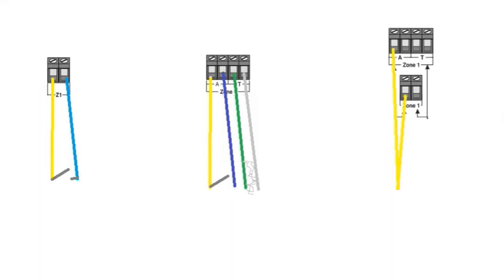And then from here, we'll go through, again, the reed switch. And this reed switch is again currently open, okay? But we need a resistor. What's a resistor? Well, it's basically something that gives resistance on the cable. So when we go through the panel, it's going to be easier to describe. It's a little bit of metal, and in the middle of that bit of metal is a variable current, basically. And what will happen is it adds a resistance on the cable, and that's what the panel will see, depending on the state.